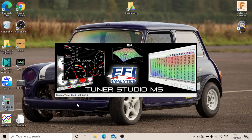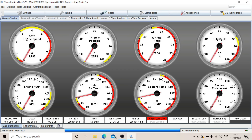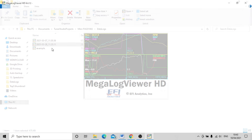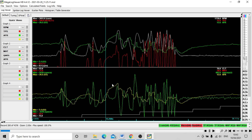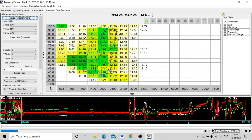So that's it — you've built your Speeduino, you've got it wired into your car. What else do you need? Well, software. Just like Megasquirt, Speeduino uses TunerStudio. It's inexpensive, easy to use, and you absolutely need it because this is how you're going to connect to, set up, and tune your Speeduino. TunerStudio also lets you data log, and there's a companion piece of software called Megalog Viewer that lets you look at these data logs in a very useful and organized way. This is very useful if you're tuning on-the-go on the road, where you're not going to be able to be at your laptop — you just want to drive it, collect all that data, and then have a look at it on your sofa. You can tune your car whilst drinking a beer. What's not to like?